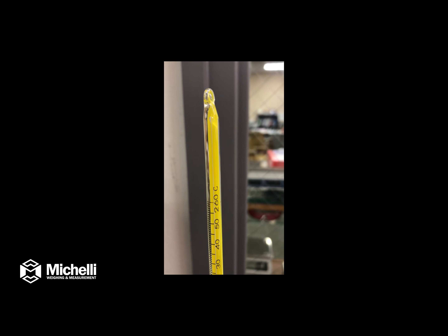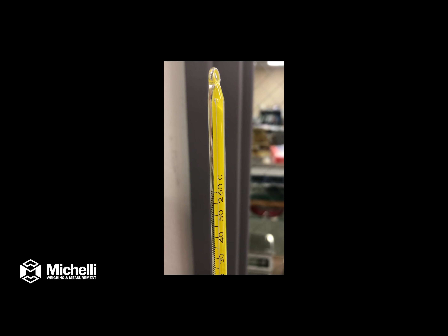There's only one way to fix this. At the very top of a mercury thermometer, there's what is called a relief bulb. If the mercury gap is close to the tip, close to the end of the mercury, you can heat the thermometer up to the point where the mercury will coalesce inside the relief bulb. Once that happens, the mercury will once again be one continuous puddle inside the vein, and then the thermometer is repaired.